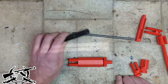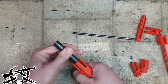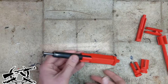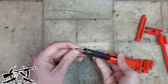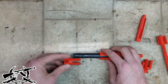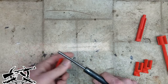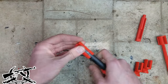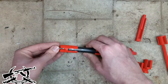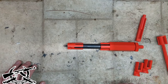These two tools fit together and the spigot on the fitting lets you hook up a rubber hose so water flows through from a pump. That water is salt water, which conducts electricity really well, making it a good electrolyte for ECM. Even when the rod is held in the middle of the barrel, it won't conduct electricity unless something bridges the gap between them — in our case, salt water. The end pilot slips over the end of the barrel and has a concentric hole to hold the rod perfectly centered down the bore so we can hook everything up electrically and run the ECM process.